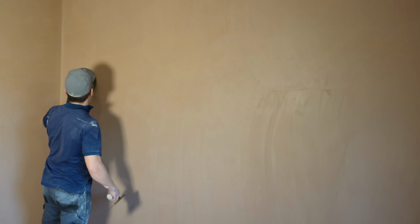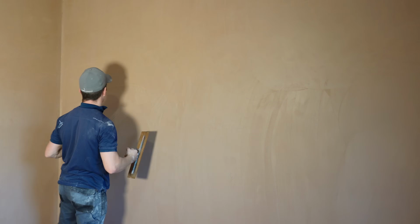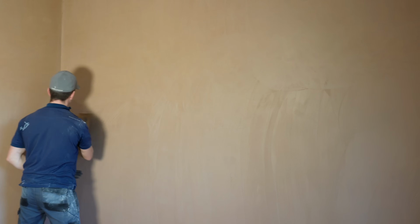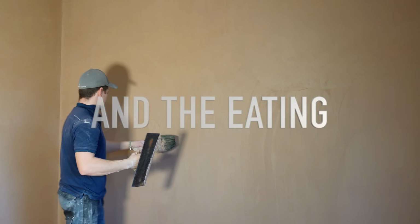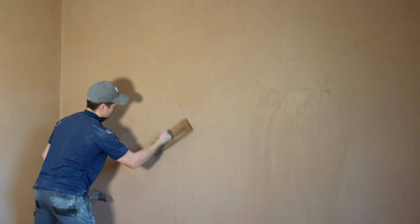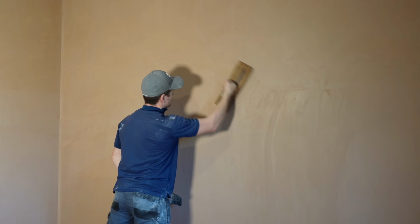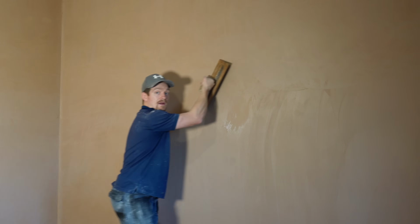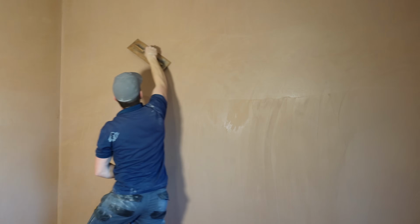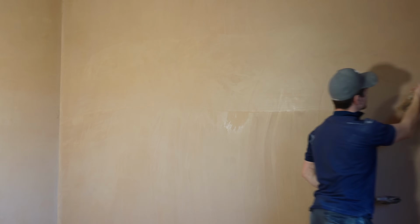So it seemed like it was going well, and all of a sudden it feels like it's just taken up, like it's just suddenly flash dried or something. Luckily I managed to flatten it, but the time we saved on the application process, for some weird reason, it feels like it's just jumped 2 steps from there, and the plaster's taken up quite hard now. So, it's not necessarily warm, it's quite cold in here actually, so it's not the temperature. It's quite weird really. We'll see what time we finish at. But judging by the clock, I don't think it's going to be far from normal time.